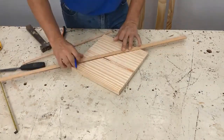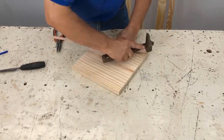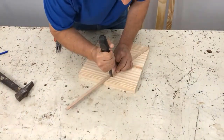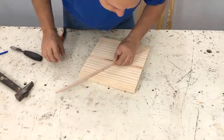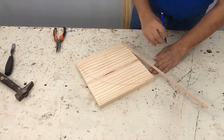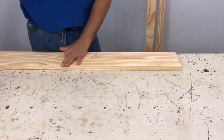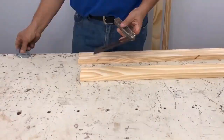We also mark this other board crossed — we mark a centimeter and place the nail at the end of the mark. Here I mark it deeper with the chisel to place the tip of the pen so that it doesn't escape, and I mark the curve. The other boards I also mark in the same way.